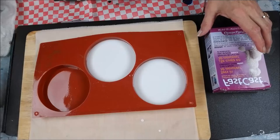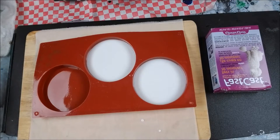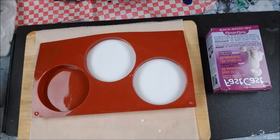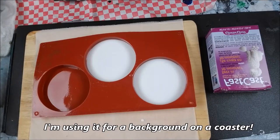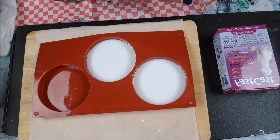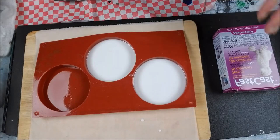Let me tell you something about the Fast Cast everybody: it sets in 10 minutes, it's a one-to-one ratio like most of your other resins. Once you pour it together the first time, you mix it for 30 seconds, then you pour it together a second time and mix that for 30 seconds. It cures white in about 10 minutes, and you can drill holes in it, paint it, spray paint it, or add inks or special Fast Cast resin paint to change or dull the color a bit.